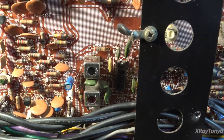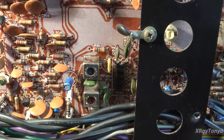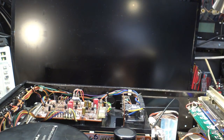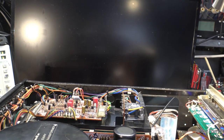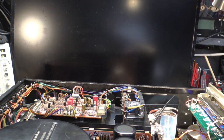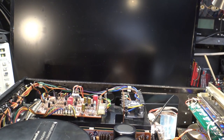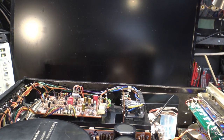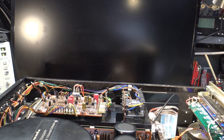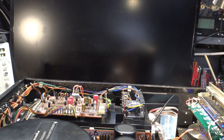I'm thinking we have a bad integrated circuit. With just a signal generator and that little test tool, that's one method you can use to poke around and inject signals into your front end or your IF of your tuner. I'm just showing you one method — there are other methods. The other thing we can do is use an oscilloscope to do a visual assessment. Let's look at that next. We're just going to look at some different angles of how we can troubleshoot this. There's no one single way — there are multiple methods. What works for you best is what you should use.